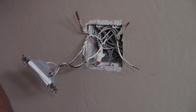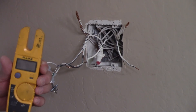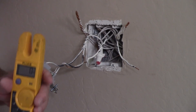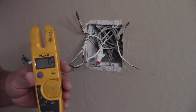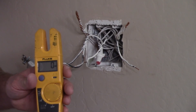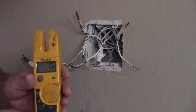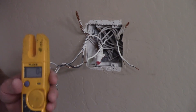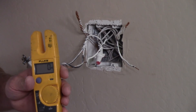Another way to identify your hot wire, if you didn't know for sure, would be to turn the power back on to the circuit and check these two with your meter. One would still be dead even with the breaker on — that would be the load wire to the light. The other one would read 120 volts when measured in reference to neutral or to ground. But I know exactly which one is the power here, so no need to go turn on that breaker.